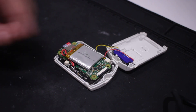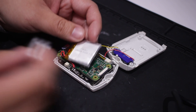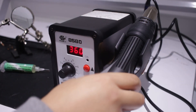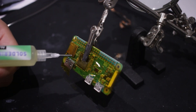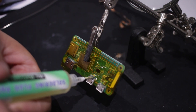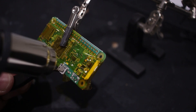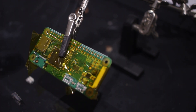I did stumble on an issue or two. The battery I used was far too thick for the whole case to close properly, so I had to replace it with a thinner one. I also desoldered and removed the USB and HDMI ports from the Raspberry Pi using my rework station. First, apply some Kapton tape so we don't accidentally remove the other components, then add some flux so the solder is lubricated and can be removed easily. At a high heat with a medium to low fan speed, I heated the area until the solder joints melted and the ports fell off, then removed them with tweezers.